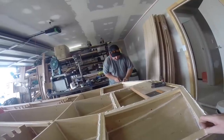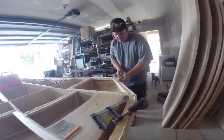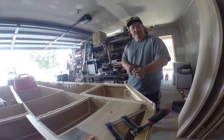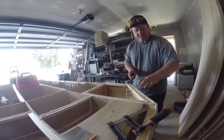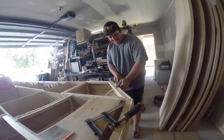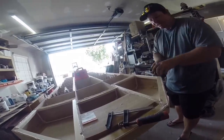You can go through and just shave the excess off. But now the trick is never do this with one hand. You should always have one hand on the blade and one hand on the handle, because then you can't accidentally go right through that finger and down to the bone sort of thing. Has someone done that before? Yeah, sort of has. So two hands on the chisel and always away from you, obviously. Go through and cut all the excess off.